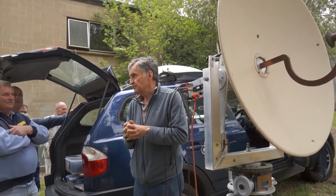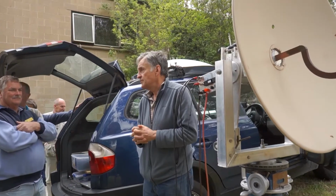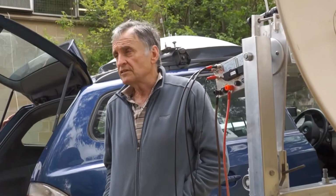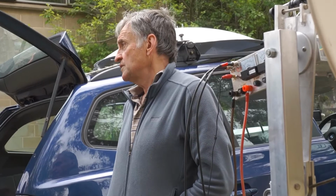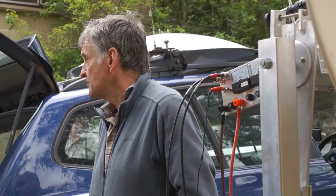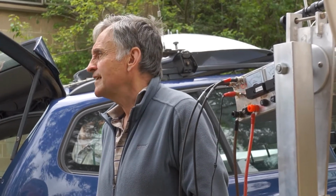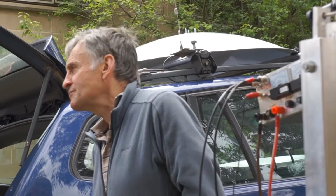I can work people with less than that. Alan has got a 3-metre dish. We have plenty to spare. Alan runs 75 watts, and typically on JT4 his signals will get down to about minus 13 dB, which is a fairly strong signal. You just hear they're there, you can't actually detect any CW.